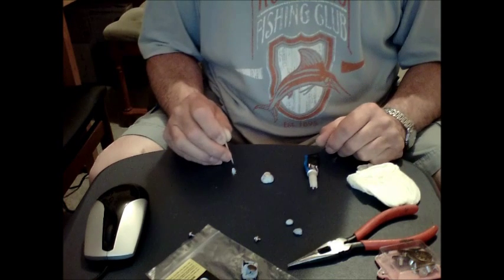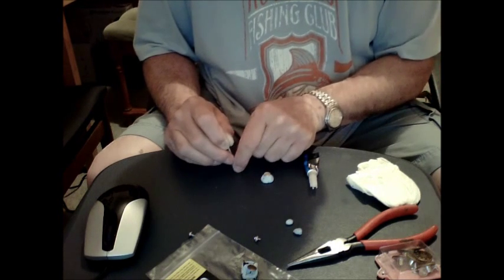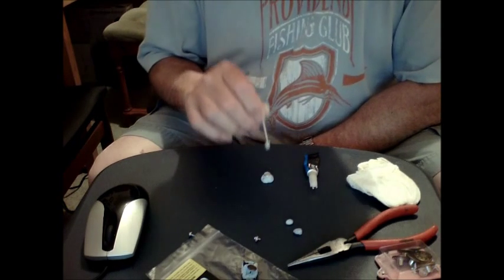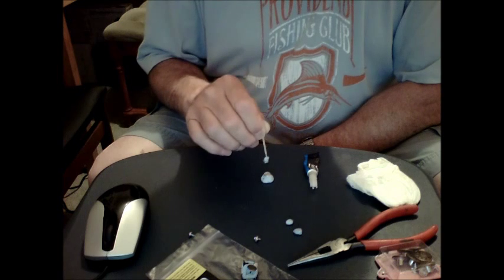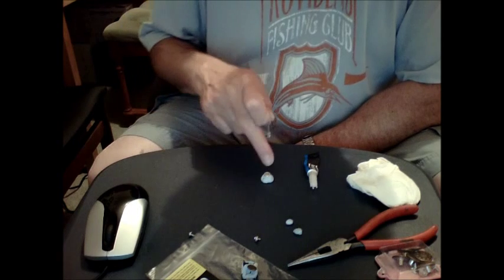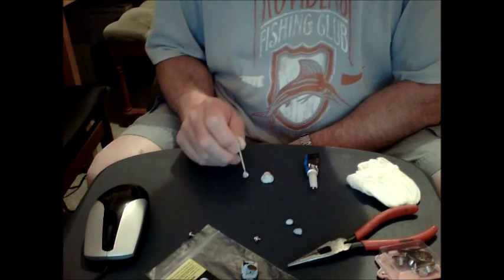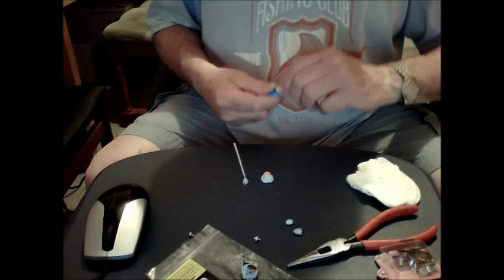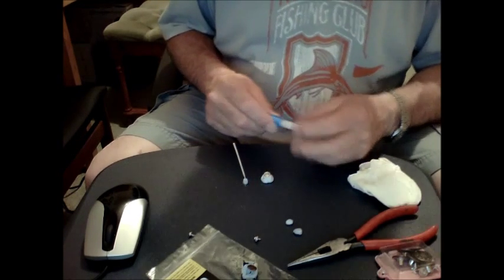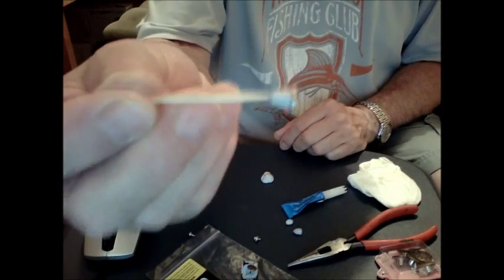A little tip: my magnet is smaller in diameter than the pin head is. I want to be able to see that I'm centered properly, so I'm putting the magnet on top of the pin. If the pin was slightly smaller than the magnet, I'd put the magnet on the table and lower the pin onto the magnet, so I could see that the smaller part is centered on the larger one. A tiny drop of super glue. Magnet held on with a piece of super glue.